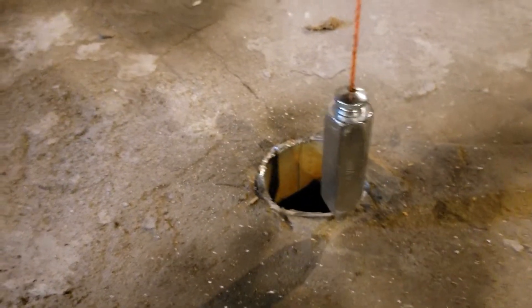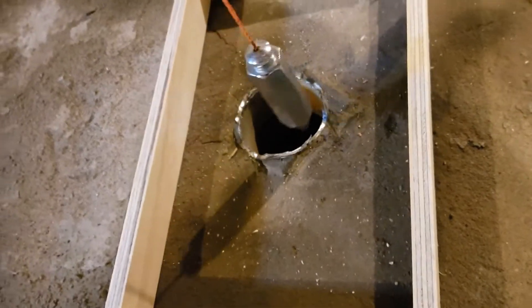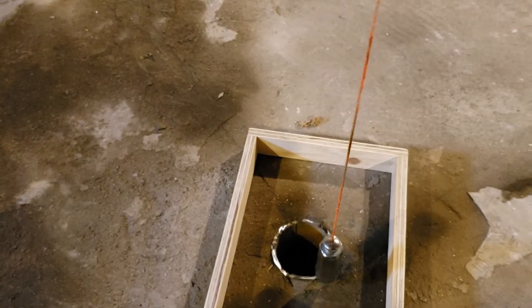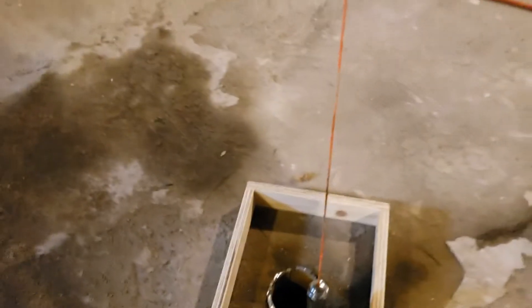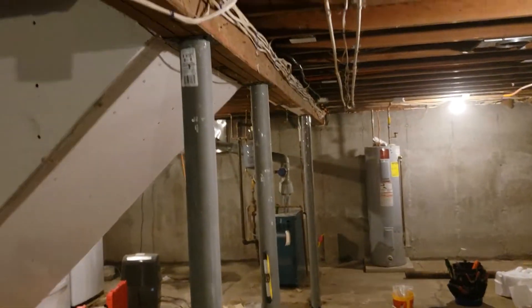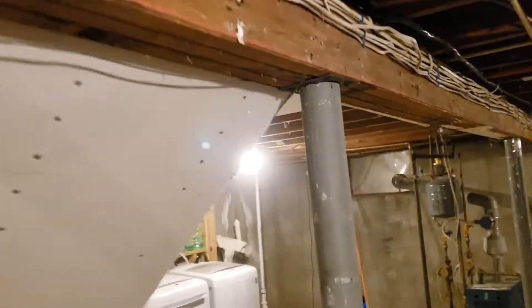I've got these little frameworks here. I'm going to put these little frameworks in like that, and I'm going to pour some concrete in there to fill the hole. Then locate my plate and kind of level it off with this little framework. As you can see, I've taken the support out of those there, and the house is back on the columns on this side.